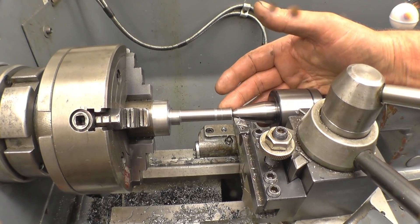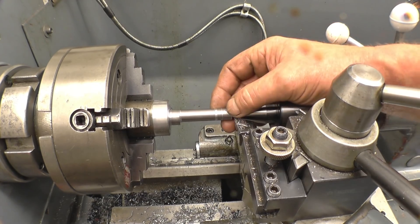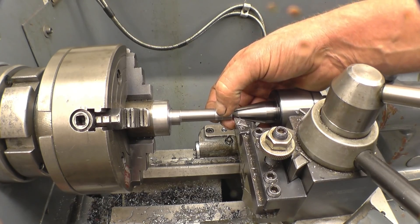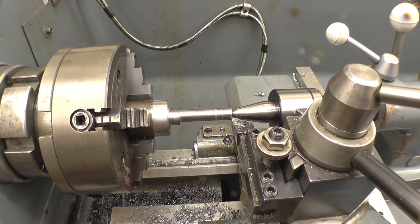Right, I'm going to make this thread 10mm, 10x1.5. It's just easier for me to do that thread — it doesn't matter what thread it is, because as the nut goes on, I've measured the distance between there and the shoulder. I used the DRO, touched there, brought it back and put a little mark so I know exactly where I'm machining down to.